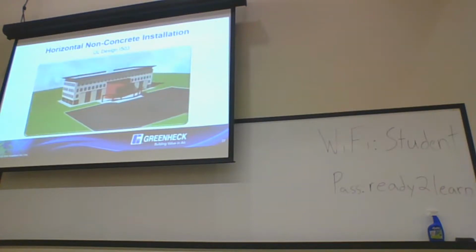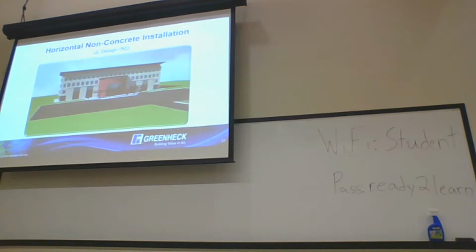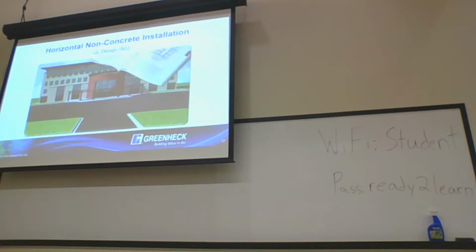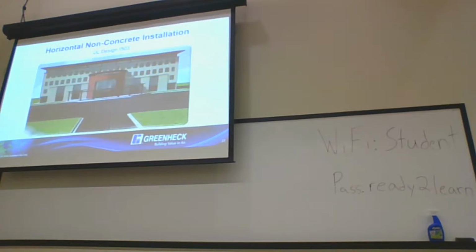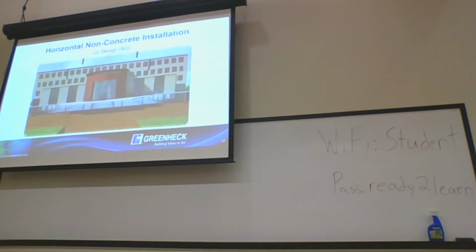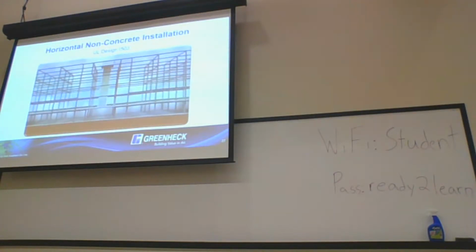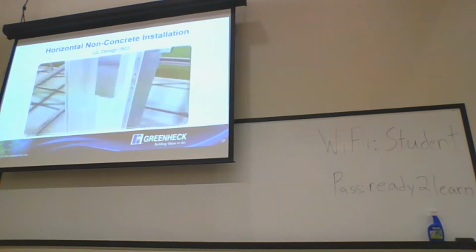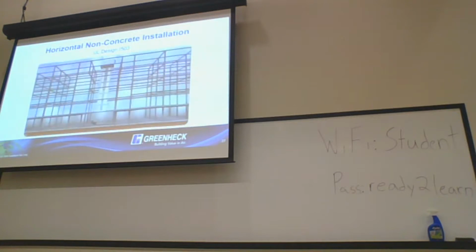Section 713 in the International Building Code addresses the provisions that apply to shafts required to protect openings and penetrations through floor-ceiling and roof-ceiling assemblies. Subsection 11 addresses the shafts that do not extend to the bottom of the building or structure. Fire-rated shafts enclose a space extending through one or more stories of a building, connecting vertical openings in successive floors or floors and roof. One of the more difficult tasks facing designers, contractors, and inspectors when working with a shaft penetrated by a duct is protecting the horizontal opening at the bottom of the rated shaft.